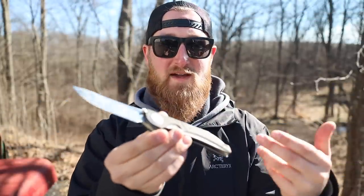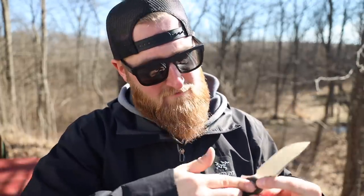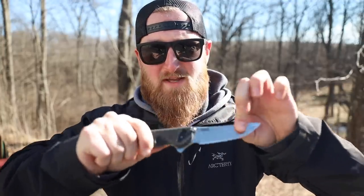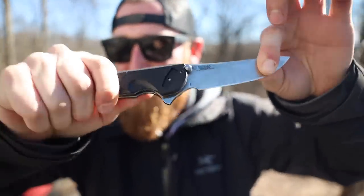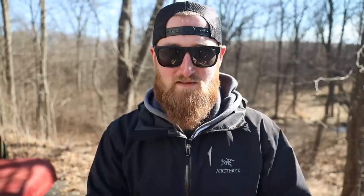So there you guys have some straight-up knife abuse on the CRKT Seismic. During that testing, the pivot did come loose there for a second. The lock up right now is still really solid — there might be a tiny bit of play, but I think the reason is that the pivot is actually loose. The screw right here is what you use to adjust the detent, and I found I could spin it with just my fingers. Tightening it up with my thumb eliminated all of the play again — no ticks, no movement. It is super solid both front and back and left and right.